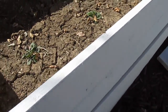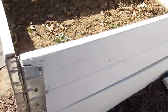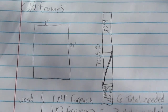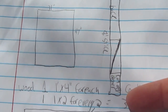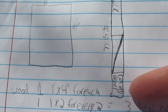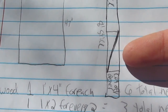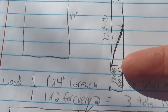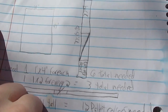The first thing we're going to do after I've put this pallet collar on is take the pre-cut wood, paint it, and put it on the side. Here are my notes — the cold frame is 31 by 47 and a half inches. I took an eight-foot stick, made the back piece 47 inches, and for the 31-inch sides I cut them on the diagonal so one goes on the left and one on the right — very efficient on space. The cutoff piece is actually going to be the piece that helps keep it open, so there's absolutely no waste.